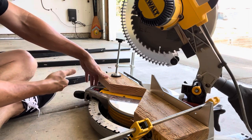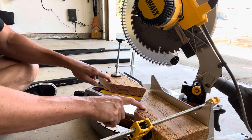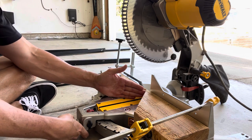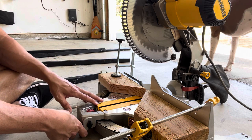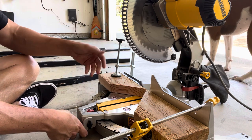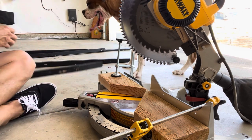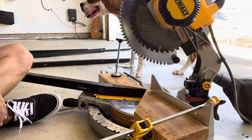The problem is miter saws only go to 50 degrees, and we need a 78-degree cut. In the description is a YouTube short that's going to show you how to set up this jig. This gives you a 45-degree angle to cut on. What we can actually do is when we go back to zero, if we place a piece of lumber here, we're still cutting at 45 degrees. This allows us to make a 78-degree cut on this saw. If we take 45 degrees and subtract that from 78, we get 33. So I move my saw over to 33 degrees, lock it in, and now when I place my lumber in this jig, I'm going to get that 78-degree cut that I want.